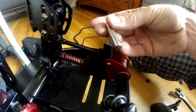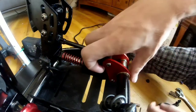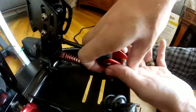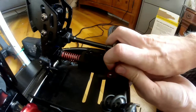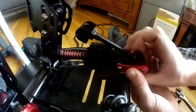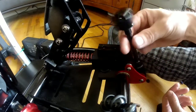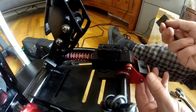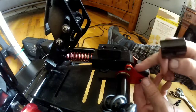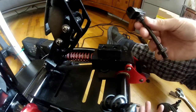Now the pin should come out. Now that you've got the pin out, this whole thing is just free floating here. So now we can just cam this backwards. Don't let this slip out — it's not too powerful with the red spring, but with the black spring it's a little more powerful. Let that cam backwards and this whole thing is just loose now. Now you just unscrew this and you might need help with the 17mm or the crescent wrench. This entire unit is no longer useful to us.